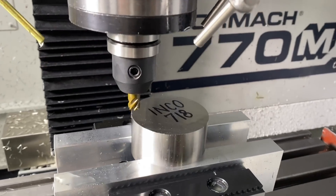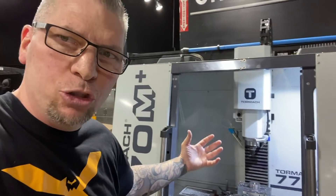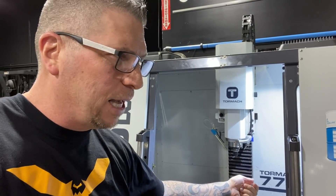Yesterday I actually created a video where we machined Inconel 718 on the Tormach. Why is that crazy? It's crazy because the Tormach has 1.5 horsepower, and Inconel 718 is a gummy nickel-based material used in the aerospace industry that people struggle with. You're not supposed to be able to cut it on this machine. It's not the DMU50, which costs hundreds of thousands of dollars. It's an awesome machine that you can put in your garage and plug into a regular outlet. At the time that I got it, this machine was less than $15,000.